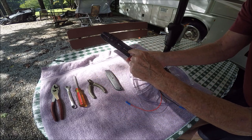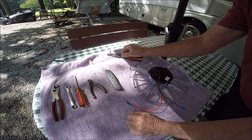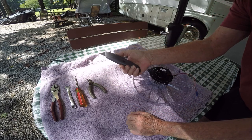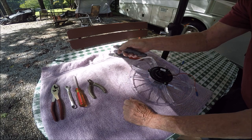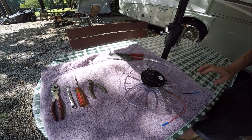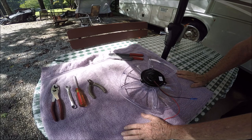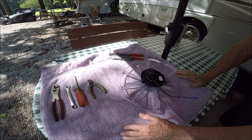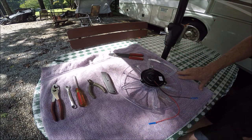An 18-gauge setting will strip the wire properly. If you don't have a stripper, you can use a box cutter — cut carefully around the wire all the way around without cutting through, then slip the insulation off. I'll show that up on the roof. To get all materials up safely, I suggest a five-gallon bucket and a rope so you can pull everything up at once. Think safety when you're up there.